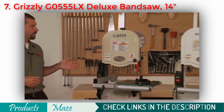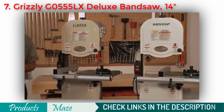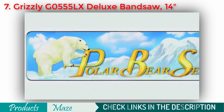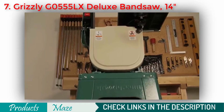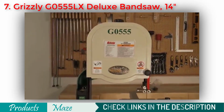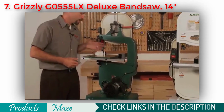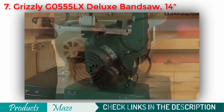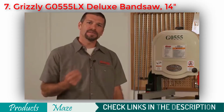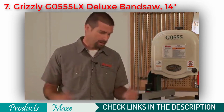The G0555 and the G0555P are the same machine, with the only difference being in color. The P in the G0555P stands for our Polar Bear series, which is white in color, while the G0555 is green and tan. This saw features a strong 1 horsepower motor that is wired for 110-220 single-phase power. It comes pre-wired to 110 volts, so you can pretty well plug it in your shop's 110 outlet and begin to use it. This is a 2-speed saw, with the blade speeds being 1,500 and 3,000 feet per minute.